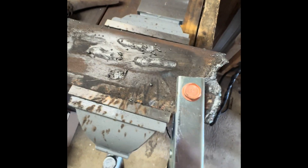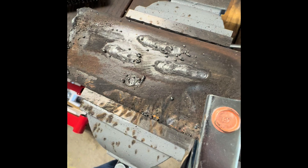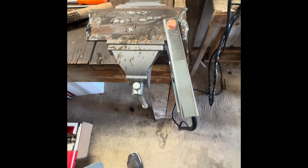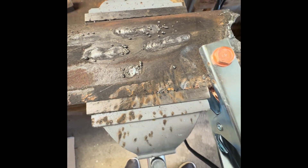You can see I've got some practice welds here. Those are my pulls, and that was my push. I caught my foot on fire pretty well with all the little beads from being flux core. But I'm going to try it with a 6013 welding rod here in a moment. We're also going to run the MIG function here with the gasless MIG.